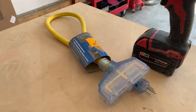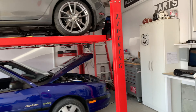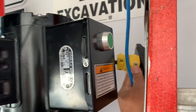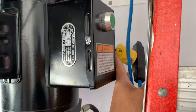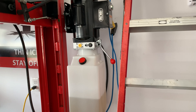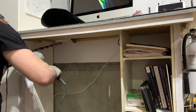We're using a 12 gauge 3-footer to replace the power source for the motor. What happened here is that this is fairly flimsy — it's only a 14 gauge or so and it requires at least a 12 gauge power supply. So we're putting a dedicated power here as I mentioned.